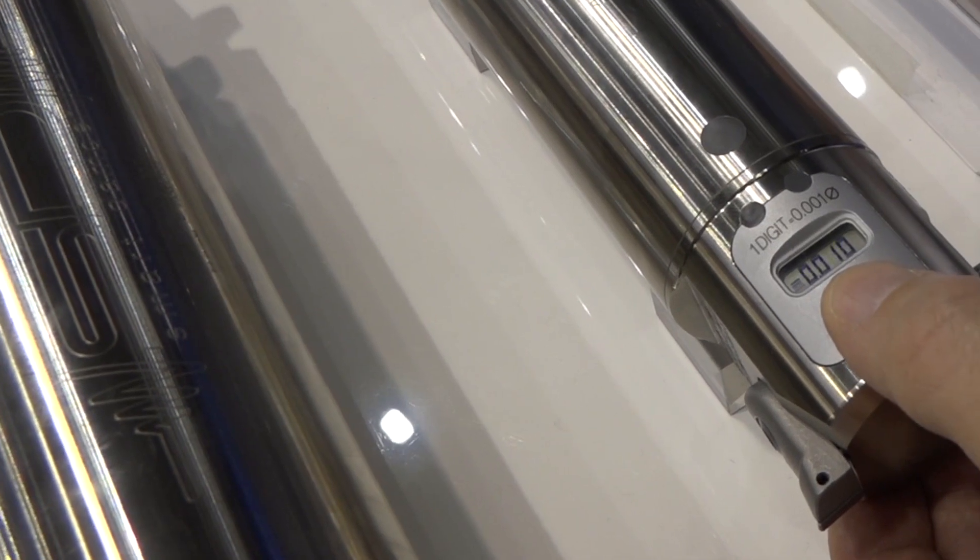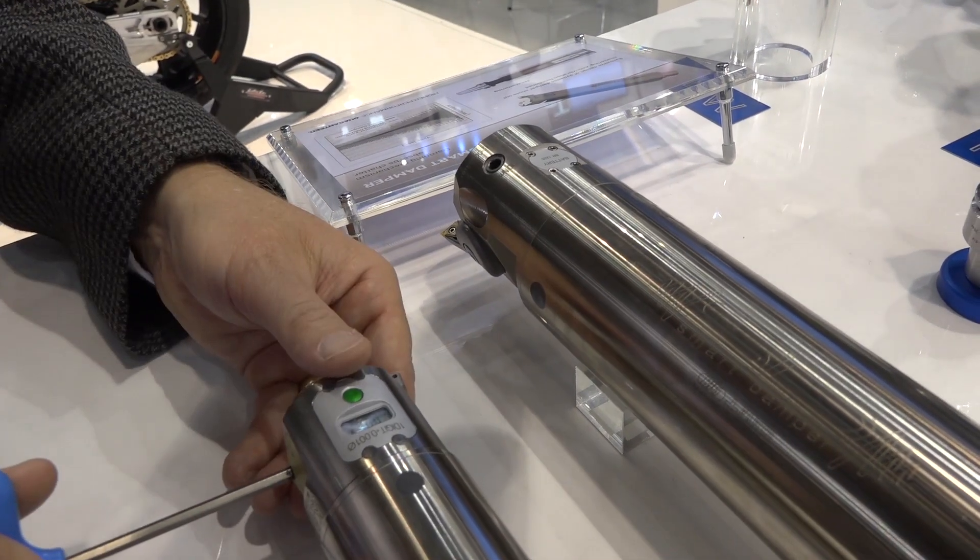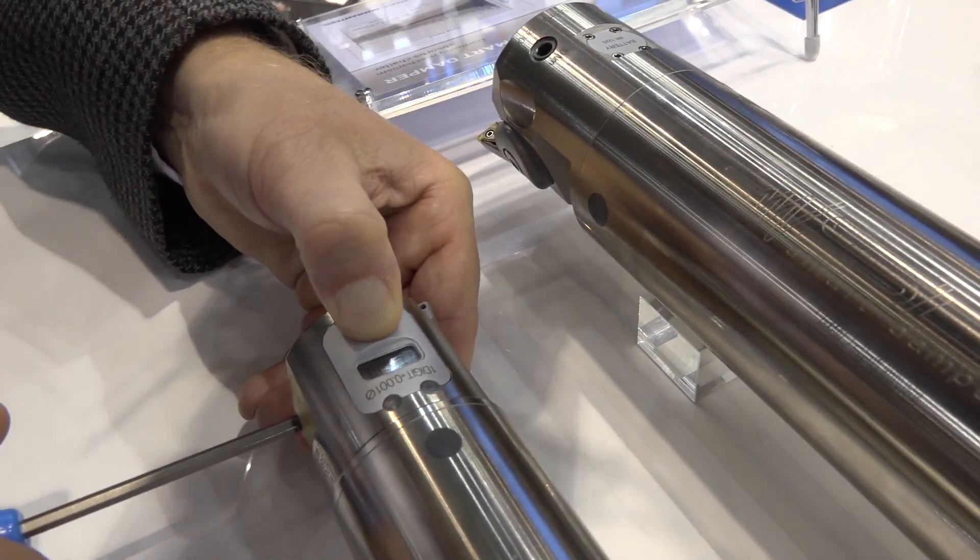Could you demonstrate the product? Sure. With our tool we can depress this green button which will actuate the digital readout. Holding the button down will read out to zero, so you can reset the tool, or it can carry on from the last diameter that was adjusted into it so the operator knows how much has already been pre-adjusted. Putting the tool into the wrench and turning, you'll see the digital numbers increase or decrease — this reads directly onto the tool carrier, giving the operator exactly the size the tool is moving without any influence from any other source.